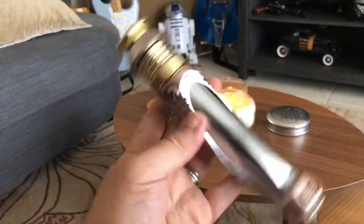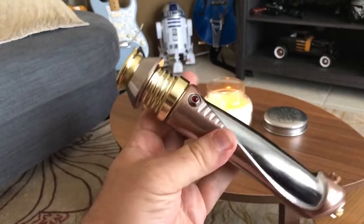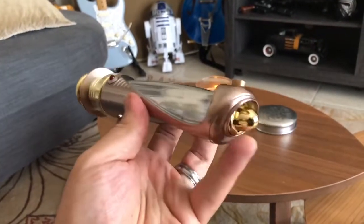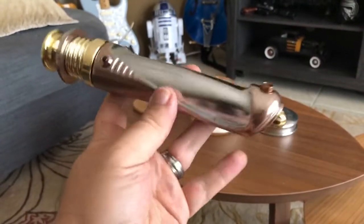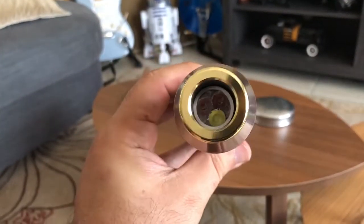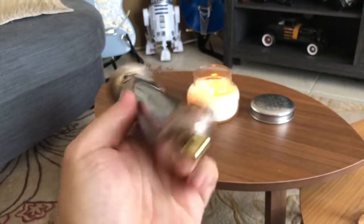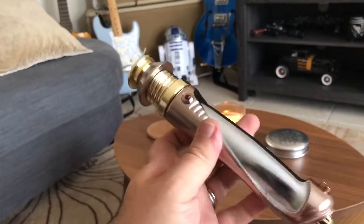He did supply just reds, so that's something that can be switched out later for a green one, maybe even the lit ones. It's got a 23 millimeter rail master speaker that I shaved down because they come square, and that fits in there. There's a Proffie chassis in here, an 18650 battery, and a tri-Cree XP-E2 deep red with a white flash-on-clash. And it's got NBv4 with three accurate City of Song fonts.